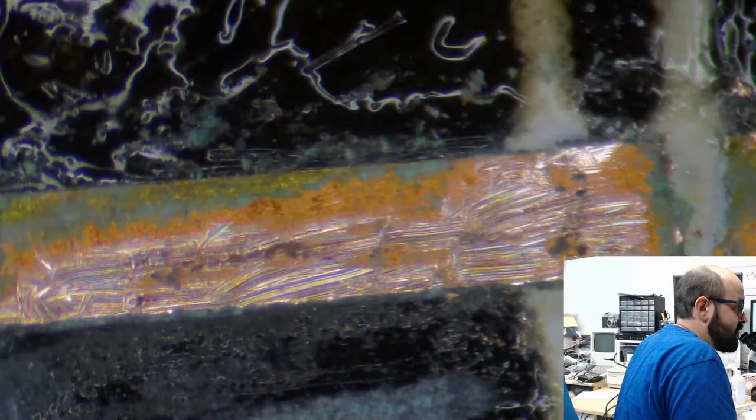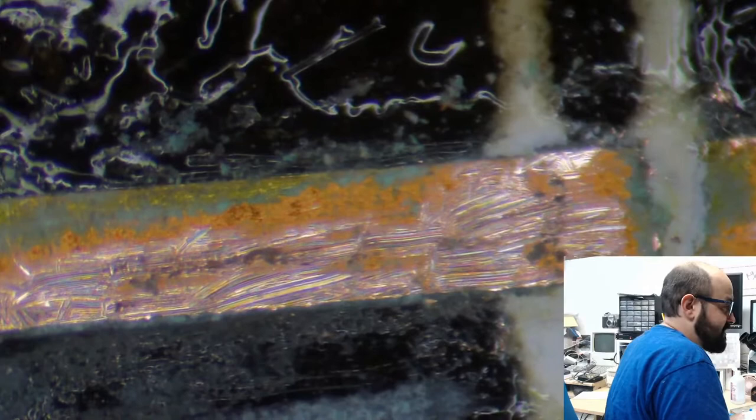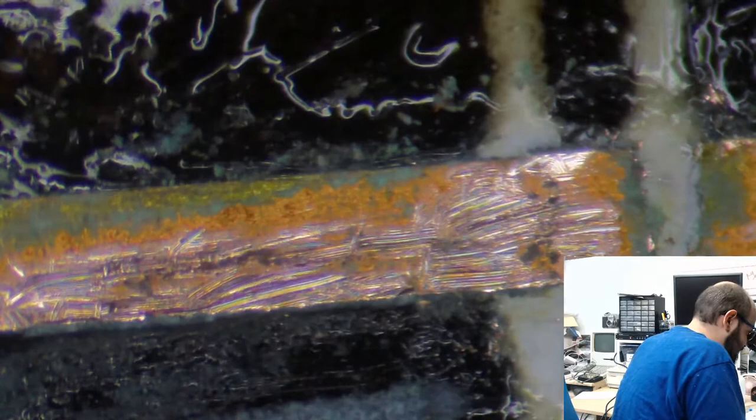Finally got Mac LC working with... What? Well, the Macintosh LC is a slow machine to begin with. So even with a SCSI hard drive, it's going to be slow. That's because it's a 32-bit processor on a 16-bit data bus. If you use that SCSI to SD adapter on another Mac, I think you'll be impressed with the results. But yes, even a SCSI to SD, you know, won't really speed that up too much.